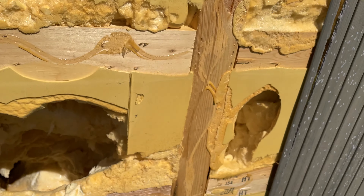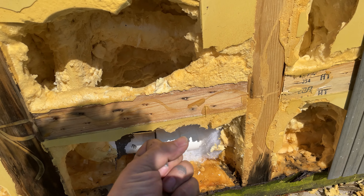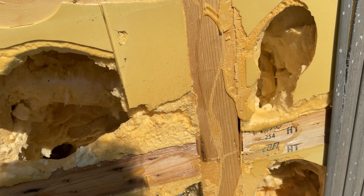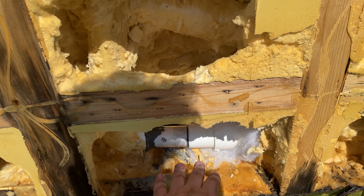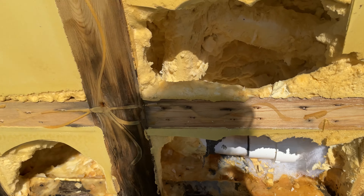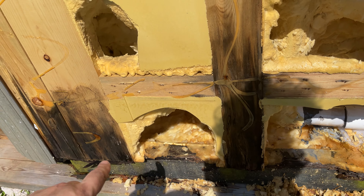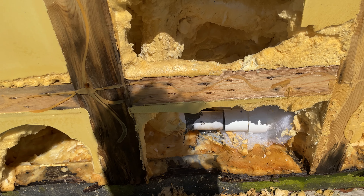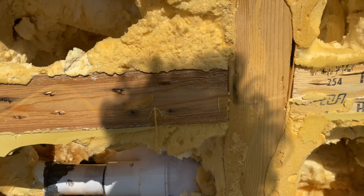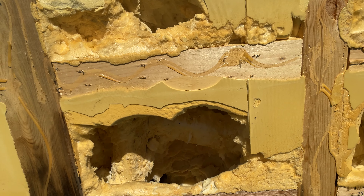The way I found the leak was — you see all these holes I punched — I started ripping the insulation out. I got up here and it was a lot drier up here, because the water will not leak past the base. It'll stay in there and only run off once it gets up to that point. The leak had been going on for a while. It's the only part of the wood that's rotted or looks nasty, and the one further back would have been a lot more work — that's why I decided to go with JB Weld.